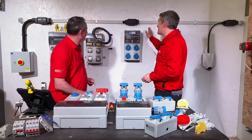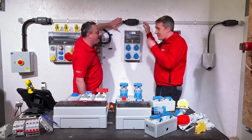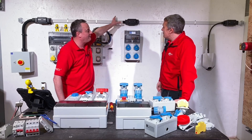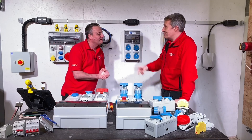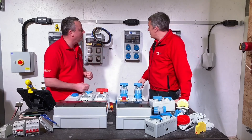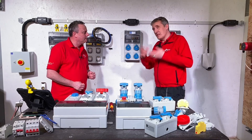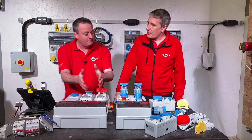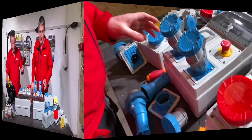Here's another option we've featured before — the flat cable system. You could run this around an industrial unit to a tap-off box, maybe with flexible conduit or tough sheath cable down to the enclosure itself. That's just a different way of thinking about industrial wiring.